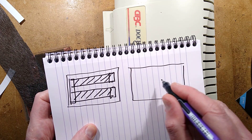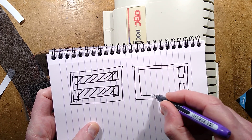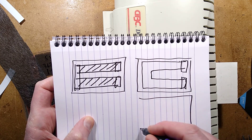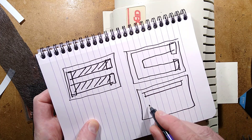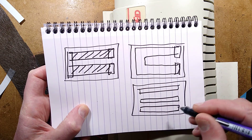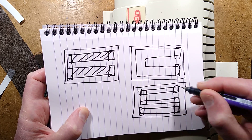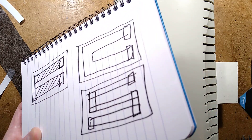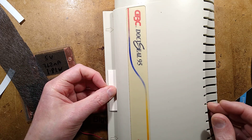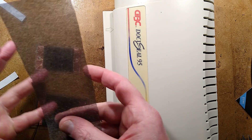You could just cut and put two bits of copper tape at one end and cut a sheet of carbon fiber with a suitable notch in the middle. You could also have three stripes of carbon fiber — the thickness of the stripe will lower the resistance — and then you could have a copper tab, a link tab, a link tab, and then a copper tab for the connection, connecting all three in series. There are many options to customize this to your own requirements.